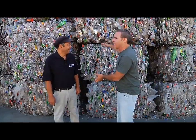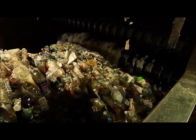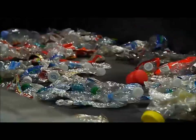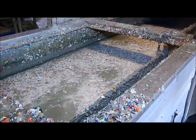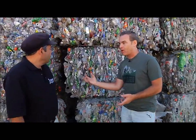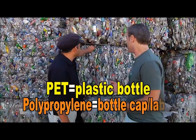So once they come here, what do you do with them? We take them to a bale breaker where it breaks the bales and they become loose bottles. They go through a sortation program where we separate the clear from the green. Then it goes to our wash line where it floats the polypropylene — the labels and the caps — away from the PET, since the PET sinks and the polypropylene floats. The PET is the bottle part, the polypropylene is the caps.